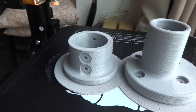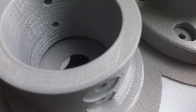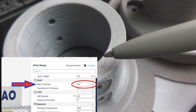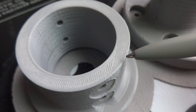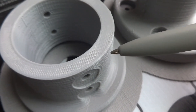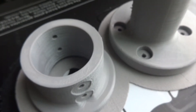The other setting to take note of is the wall thickness. You can actually see it here — the wall thickness refers to the smooth lining on the outer wall. This setting is 0.8. And then in between is the infill, and then the other side is another wall. So that is the wall thickness. I use 0.8 usually if I want something tougher. I use 0.4 if I don't need it to be that tough — and it will also print a little bit faster.